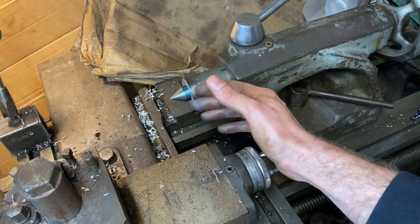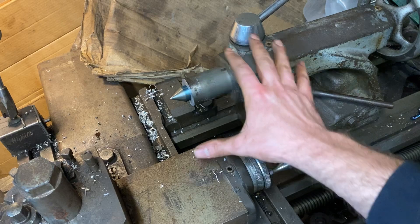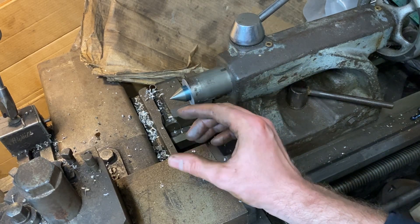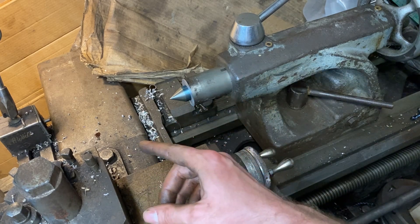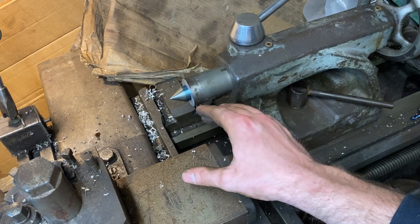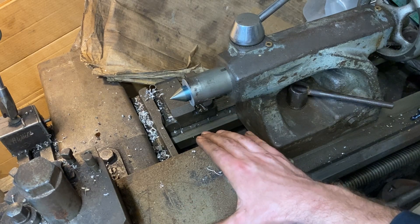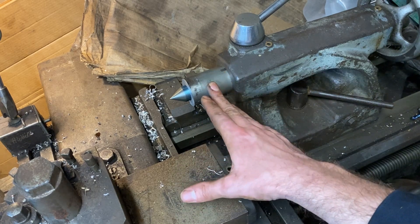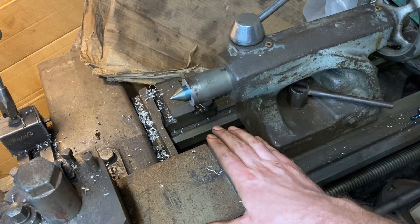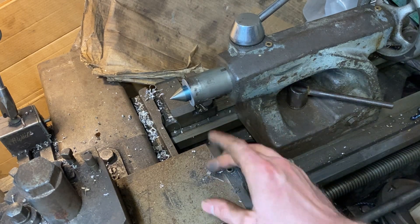If you are planning on doing that, just be aware that you need a very rigid setup — you don't want this moving about. You need to get your reamer absolutely bang smack on the centre line of the axis of the lathe, because otherwise you could ream it off-centre and that would be a disaster. But generally speaking it's a fairly simple, straightforward job, and certainly something you could try yourself if yours is as damaged as mine was. Hopefully you've enjoyed that — just a quick one today, but stay tuned for more. From Yorkshire Fab Shop, thanks for watching, see you next time.